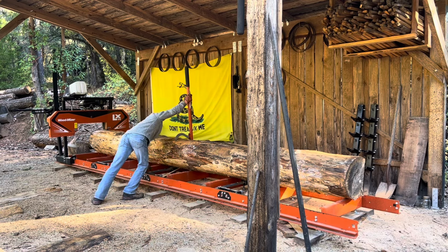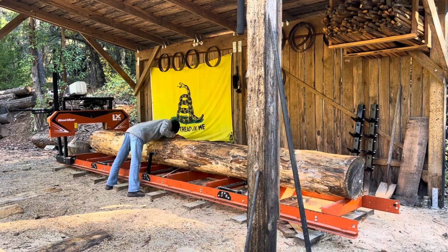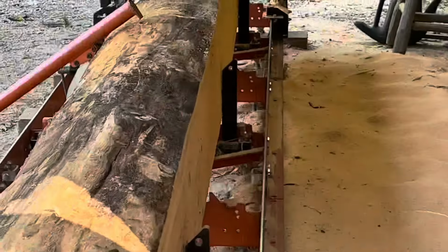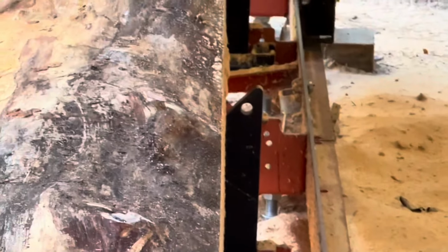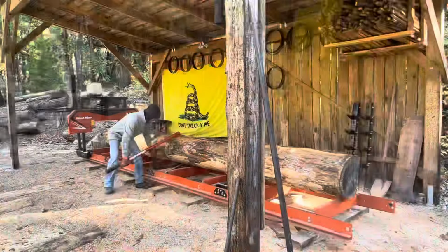And here again, I'll just put this one clamp in. I'll hold it. I'll check it. And in this case, it wasn't quite perfect. I tried to video it. It was hard to see, but I just want to stress how much this first roll is so critical. And you're on rounds at the bottom, so you've got to get it just perfectly parallel to those back clamps. I tried to zoom in, and I didn't know if you could catch that tiny little gap at the top. I mean, it's not much at all, but that's what makes the difference, and I'm going to fix it. And then I'll know I'm perfectly square when I make my second cut.